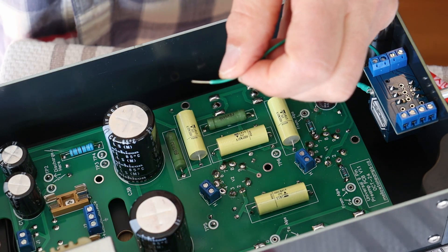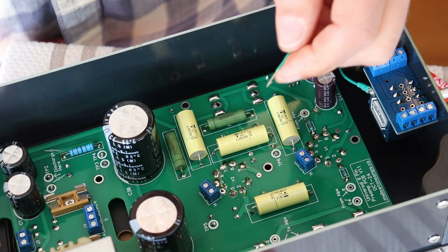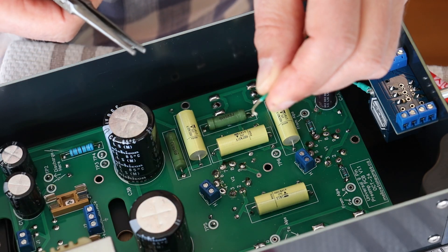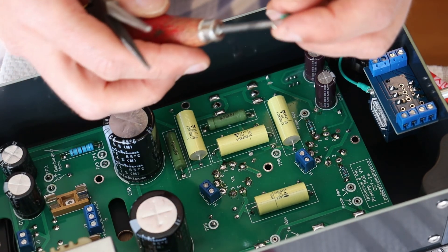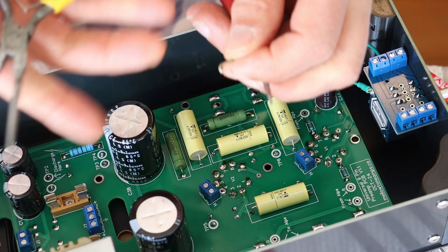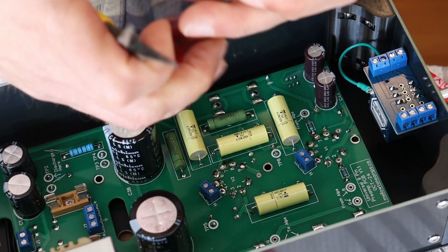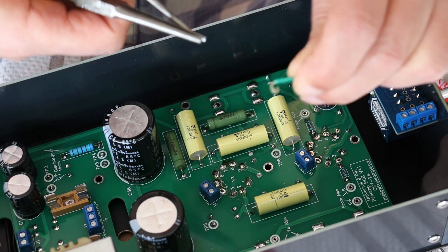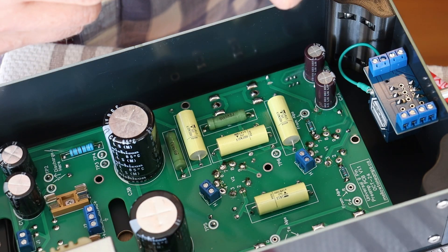The better quality the insulation on wires, the harder it is to strip them — that's the general rule, until you get up to silicone wire and then it's a real breeze. To make a turn on that, you can start a little bit of a turn with some needle nose pliers and then just clamp onto something nice and fine. Clamp on your needle nose and just turn it around a little bit. You've got a nice little hook there — that's all we want — and you can improve that a little bit with your needle nose pliers.